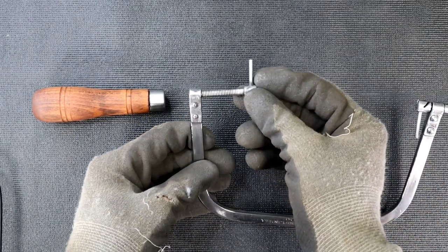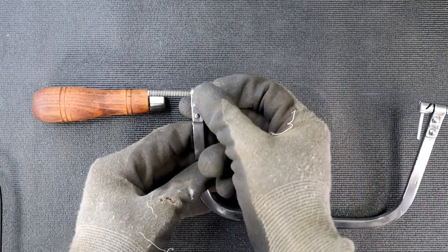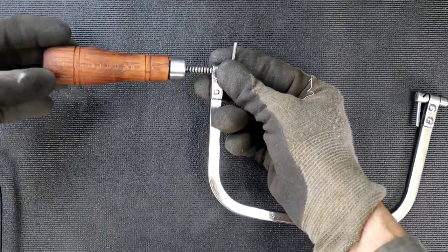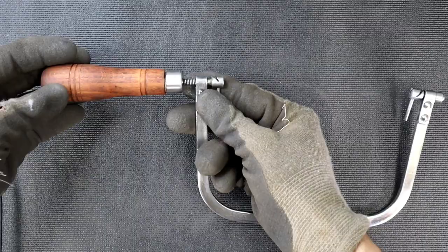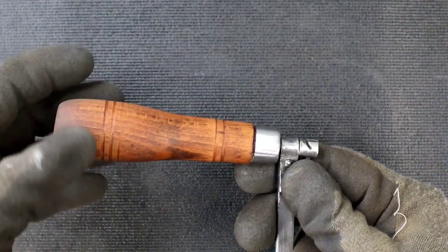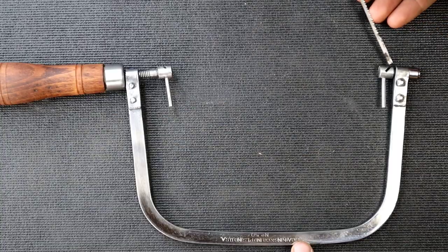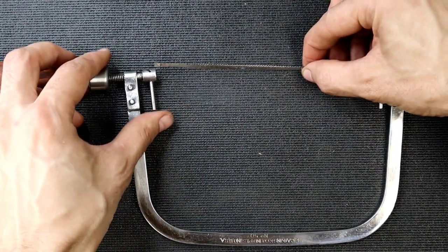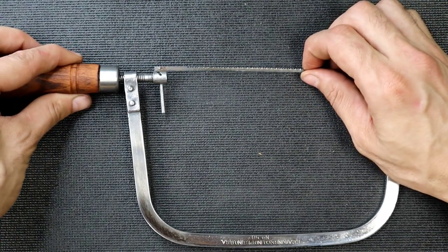The handle is almost dead-on and all the exposed metal pieces look factory clean. When putting the handle back on, ease the screw into the socket to prevent any cross-threading. Carefully bring the screw all the way back onto the handle just to make sure there isn't any binding along the way. Back it out to allow for the installation of the blade. I used an American-made Olsen blade here, which provides a smooth, accurate cut.